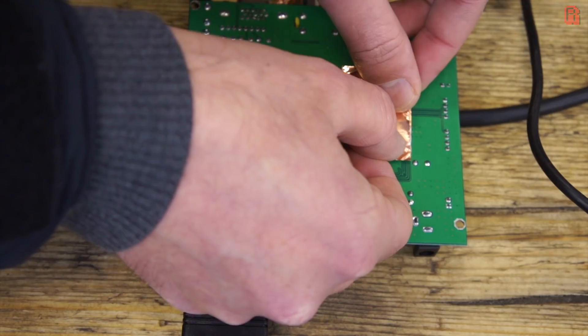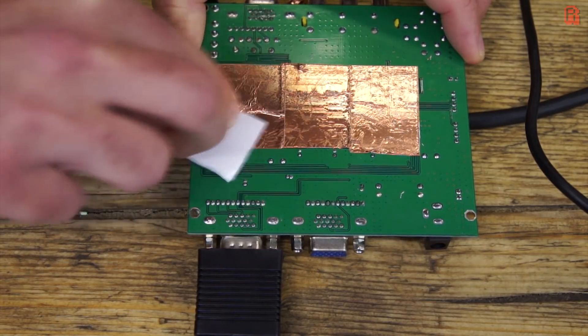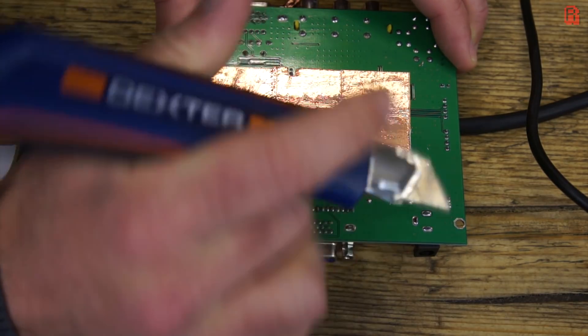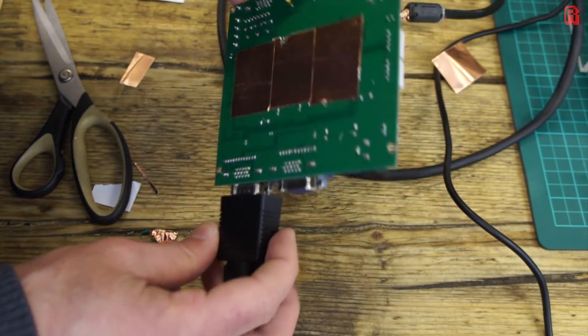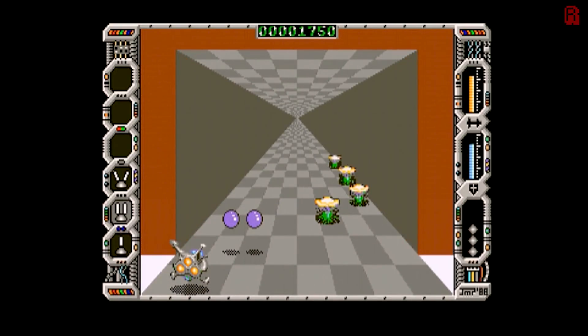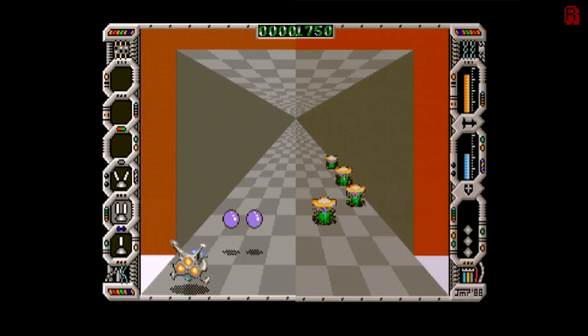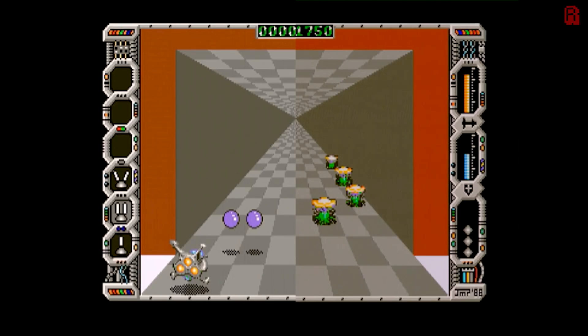This was very promising. I went ahead and stuck copper tape across the traces, again being careful to give clearance around any component pins, and rubbed the wrinkles out for a nice flush finish. The result was very pleasing indeed. Here's Eliminator as we run up to the tunnel and pause it — and in a side-by-side comparison, with the copper tape fix on the left and no tape on the right, it's a vast improvement in noise levels. The pictures speak for themselves; everything just looks so much better with the copper tape in place.